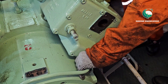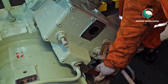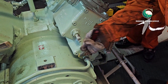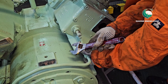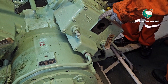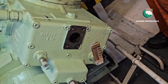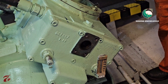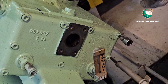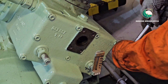Once the air pipes are open, open any other connection on the cover — this is the air cooler cover. We are removing the drain pipe, which is already removed. Now remove all the Allen bolts of the cover. Put a marking on the cover and the body, then start opening. Always ensure you are using proper tools for opening the bolts.